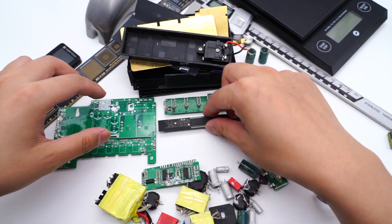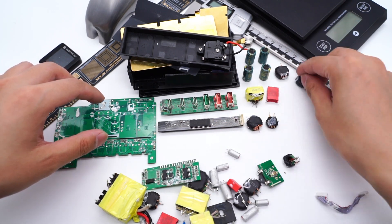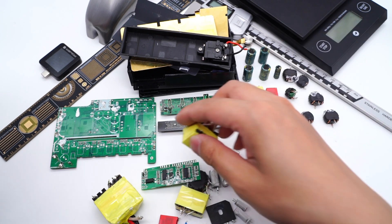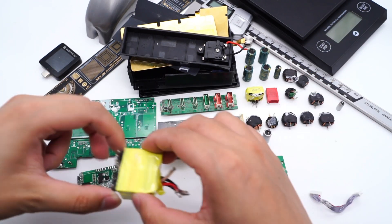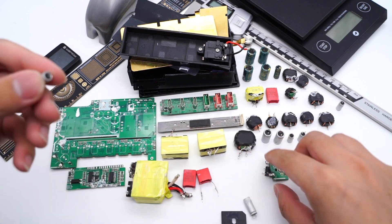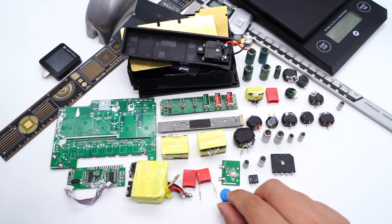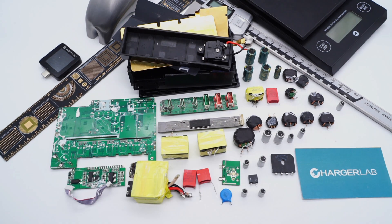That's all the components of this powerful 240W charger. It adopts a staggered PFC circuit and LLC topology. First, it outputs a fixed voltage, and the secondary step-down PCB controls the output power of each port. This charger is composed of multiple small PCBs, which improves space utilization, and the front and back of the PCB-A module are covered with heat sinks to enhance heat dissipation performance. Please drop a like, leave your comments, and subscribe to us. I'll catch you guys in the next video. Bye.